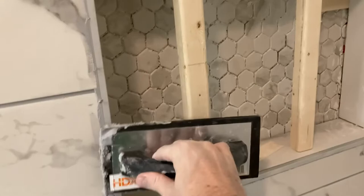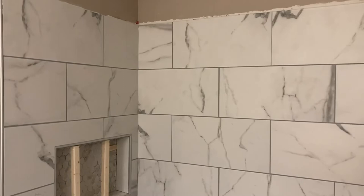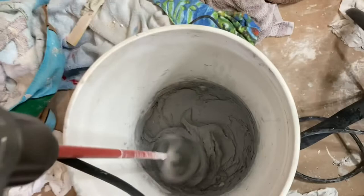I have the advantage of white tiles so the haze isn't as noticeable, but you can feel it with your finger. Wipe with a clean wet sponge or paper towel until the haze is gone. Here you can see it drying to a really nice stainless steel or rain color, just as the instructions indicate — it definitely goes on darker and dries lighter gray. Because of my prior testing, I knew exactly what color it would apply and what color it would dry.